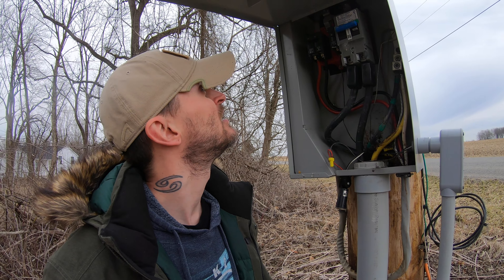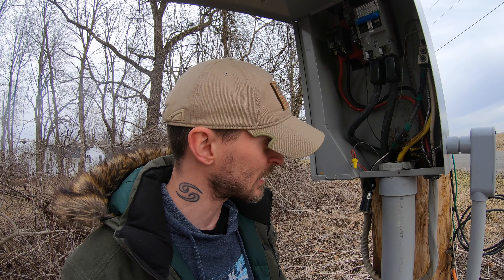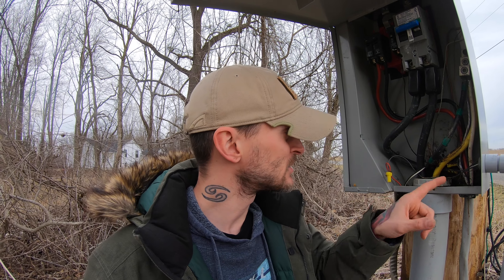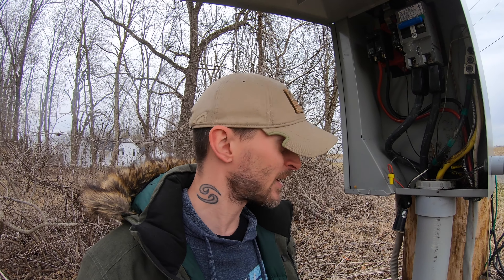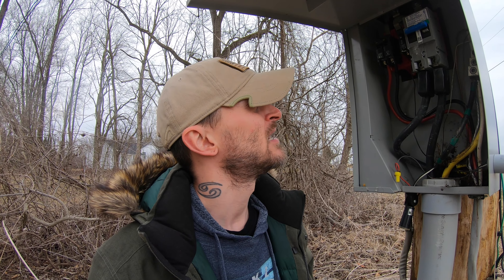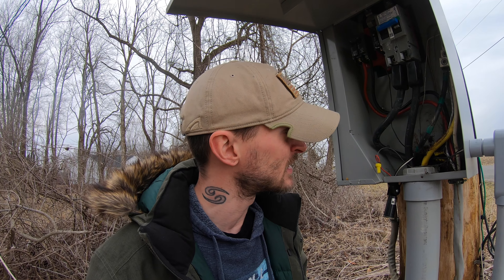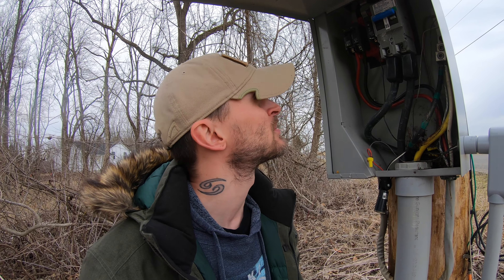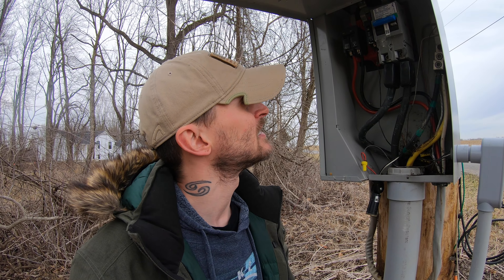Yeah, this is not good — especially I need to investigate more, especially if they got any wire off of the main wire or off of the neutral or off of the ground. That is a bad situation. I think I'm going to have to run to the store, cover up this hole. The best thing I can think of is they do make a rodent spray foam — so if I get it all up in here and they try to climb back up and chew through it, maybe it's got some sort of property they don't like to taste. Other than that, I don't know what to do, but we have to clean this out and get rid of all of this so the acidic urine isn't eating through this. I am freaking pissed off right now.